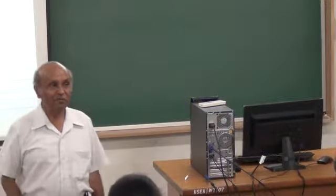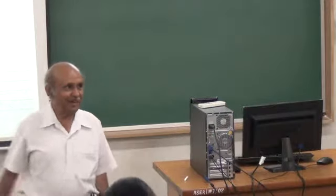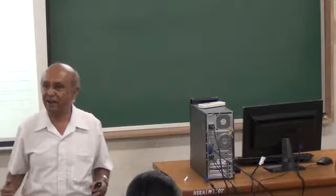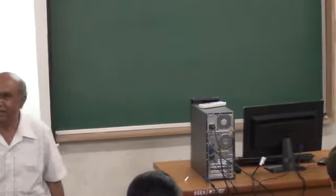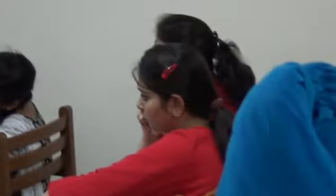So, only for cases like this, where it crosses, you will have the phenomenon of neutral temperature. You will not have it in a practical thermocouple. Whatever temperature we are varying, this is the temperature difference at the junction. The other part is at ambient temperature. Cold junction? There is no cold.